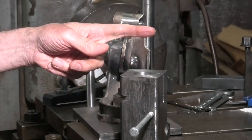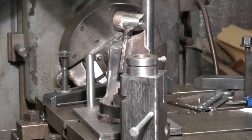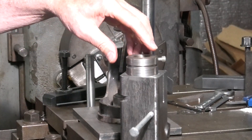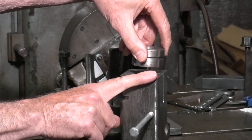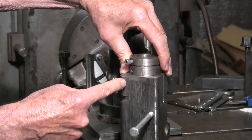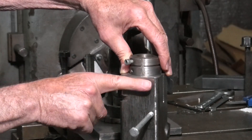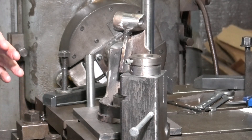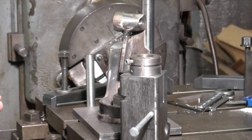It's got to come over quite a bit closer to the bore. Imagine a disc similar to this turning with the spindle — out of it will be either short shafts or small ball bearings, and they will ride up on an angled plate on the side. As they rise up they'll drop down on the other side, giving you actual relief. I'll have a plate pivoted at the bottom; a fastener up the top with a slot in the plate so you can pivot the plate out and control the amount of clearance. It's quite an ingenious idea — it doesn't give you a perfect clinical clearance, but it does a good enough job.